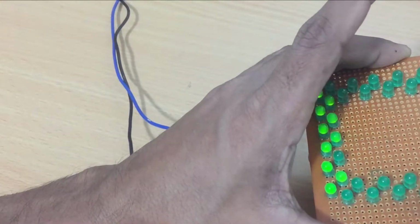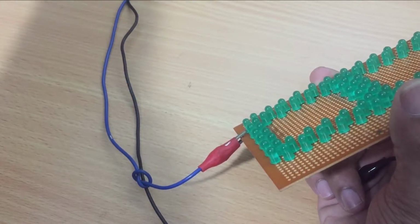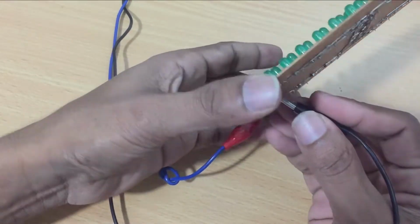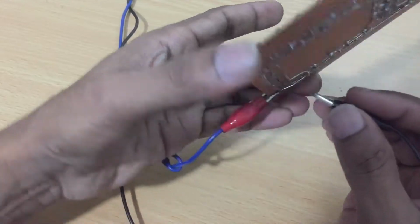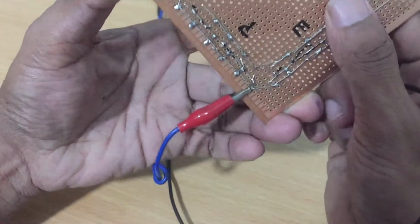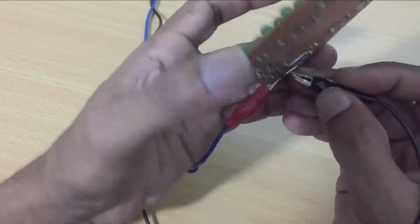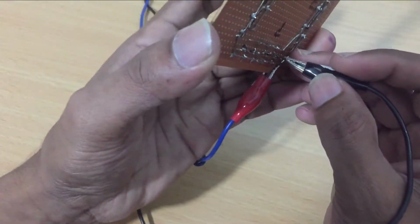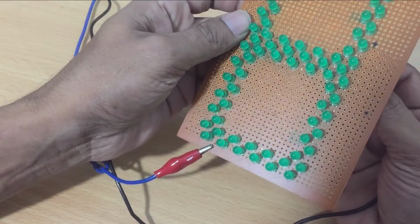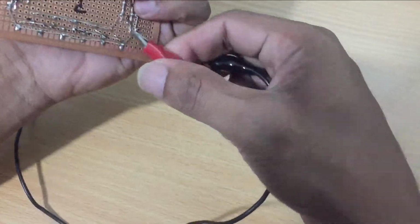Sometimes an LED may burn due to manufacturer faults or by your hand, because sometimes the temperature of your soldering iron will kill your LEDs. If you are using a soldering station, make sure not to increase it more than 300 Celsius, and also do not heat the LED or the soldering too much. If you use an ordinary solder, it is better to use a 30-watt soldering iron.